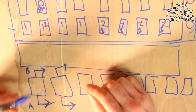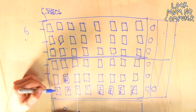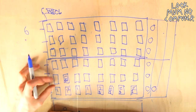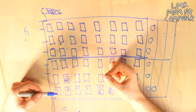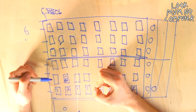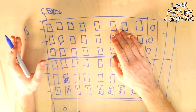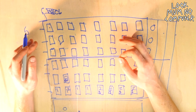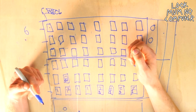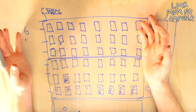What you can do is create a switch, so you flick it to A and B. But the problem is when there's six that are exactly the same, you need these to be matched. So if I flick a switch, it sends all of these six Game Boys to their designated paths, but separately. I know it's a head fudge. It's a bit much to think about, but basically, instead of a switch, I need a voltage controlled switch. So you flick it on and then the switches behind these do what you need to do.